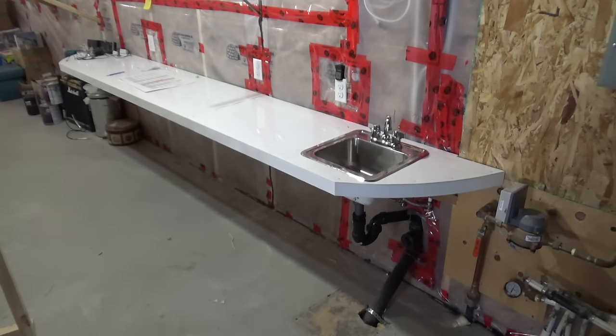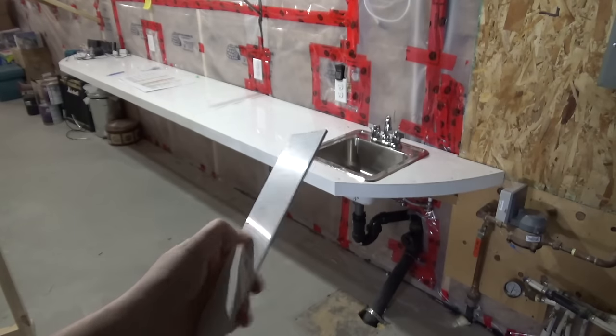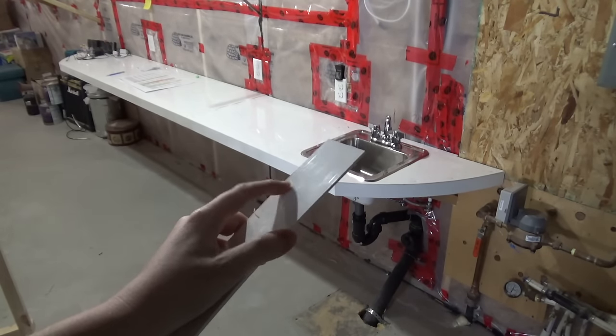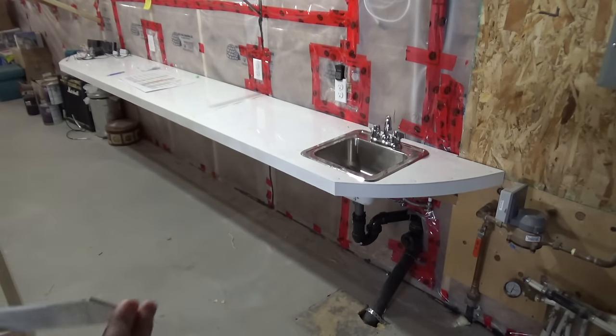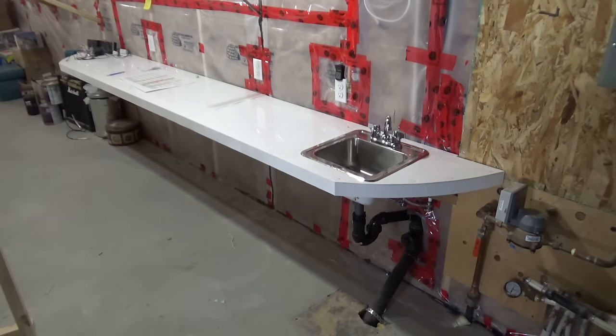And what I ended up figuring out worked well. And I wish I would have figured it out before I drilled holes in it and put some screws in. But if I sanded the back of this with a really rough sanding disc, I used my Multimaster, if I sanded the back of the strip and then I glued it on and clamped it, it's rock solid. So all the trim on the front of the workbench is all glued on and it's just so solid on there.